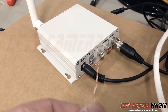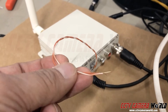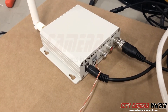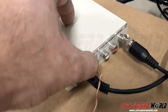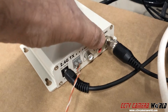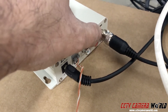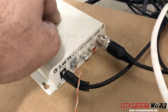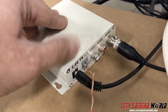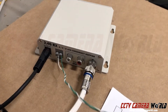Connections are very simple. They come with 12-volt DC power supplies — that's where the 12-volt DC power supply plugs in. This is where your RS-485 positive and negative come in. I've wired this so that the stripe wire is positive and the solid wire is negative, taken from a Cat 5e. You should use Cat 5e to connect the RS-485 because it properly locks into the push-in connectors. There's audio here but we're not using that. Since this is a video-only PTZ, the BNC video comes in here from the camera — so you've got BNC for video, RS-485 for controlling the PTZ, and 12-volt DC to power the transmitter.